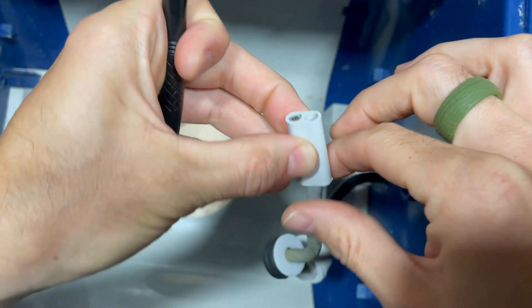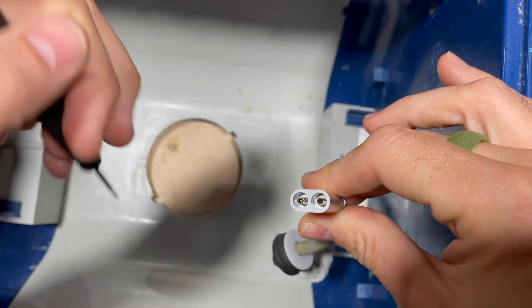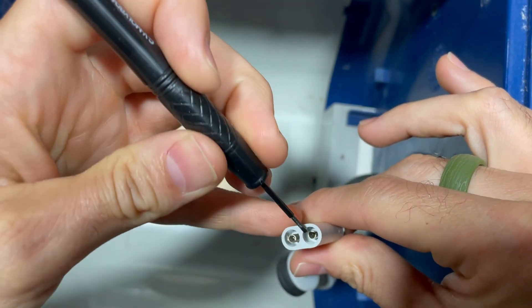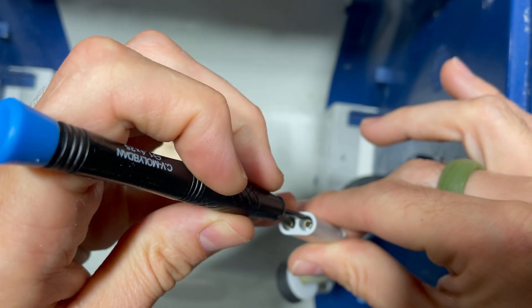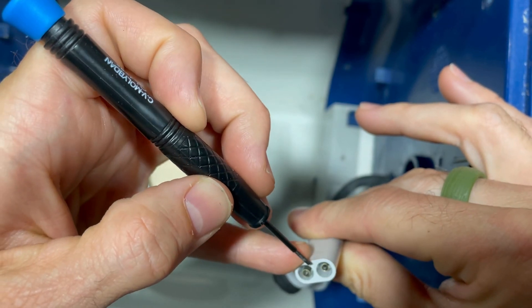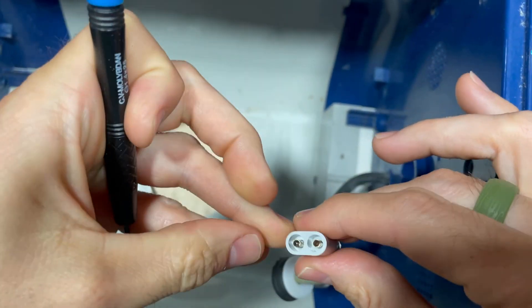The first thing you have to do is remove these two wires out of the casing. Each plug has two bent-out metal prongs that keep it from pulling back out, so you have to bend them back in in order to pull the wire out. I took a small flat screwdriver and stuck it down next to the prong, then turned the screwdriver a little bit to push the prong back in. There are two of them on each side — if you look with a flashlight you can see them. I stuck my screwdriver in, turned it twice, and then I was able to pull the thing out.